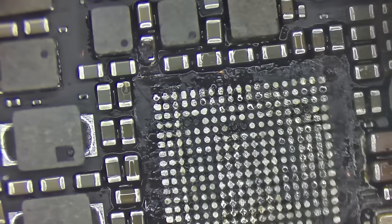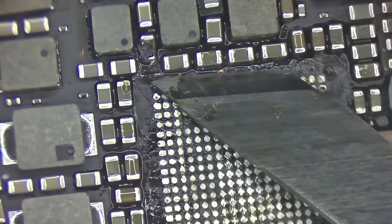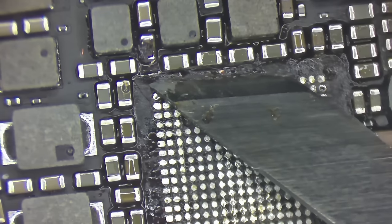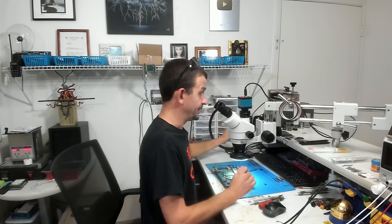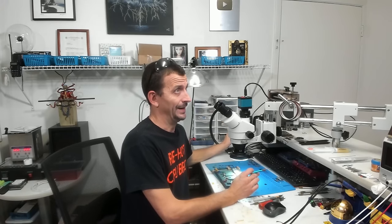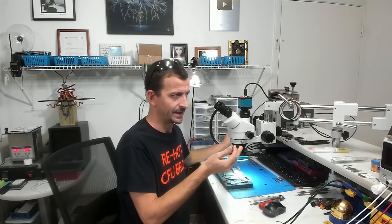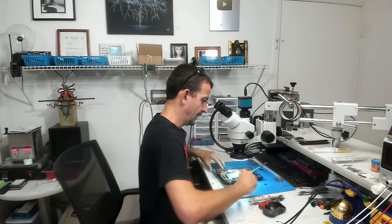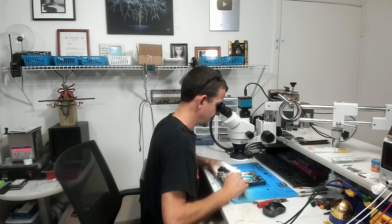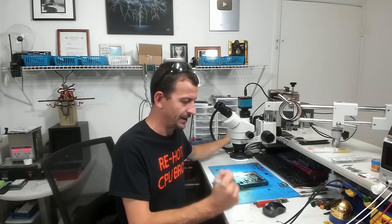Yeah, I really, really should have tested this better before I let it out the door. I feel terrible for this shop. I should not have let this go out the door without doing more thorough testing. But to be 100% honest, I didn't have an iPad Air 2 battery. I had a battery that had the same exact pin pattern on the bottom. The polarity was right. I plugged it in. I saw proper charging current. I saw boot. Knowing that all my soldering work was good, TriStar, DocFlex, I disconnected it and sent it out the door.